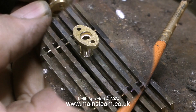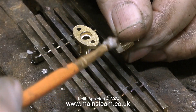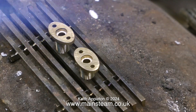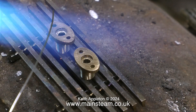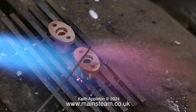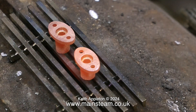I'm coating the ends of the adapters with some silver solder flux. You'll notice that the quarter by 40 part of the union adapters doesn't go all the way through the flange — there's a reason for this. With both flanges sat on their respective union adapters it's time to silver solder them together. The brass part doesn't come to the end of the flange because the silver solder would make the end of the flange that fits the engine uneven.